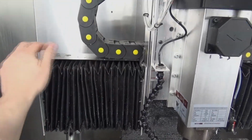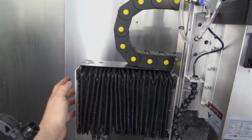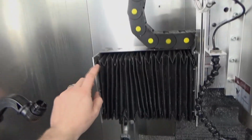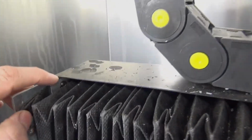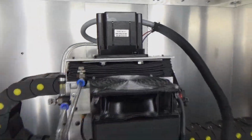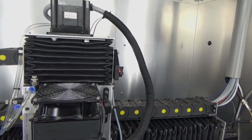Sheet metal capturing cover here and on the bottom, just aluminum end plates basically that cap out the end and give you somewhere to attach the bellow. These were kind of a pain too. I had to cut these little pieces of strap for here and all of the edges to hold the ends down, and I had to punch through the vinyl for the holes. So that was quite the job. I've got one here, it's crunched up obviously. You can see there how that works.